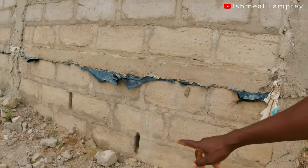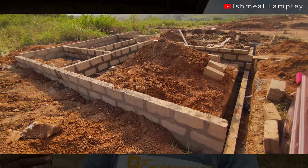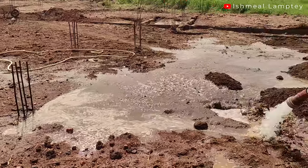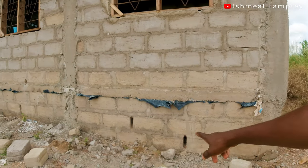One thing we had to take into consideration when doing the foundation was the spaces you'll notice at some points between the blocks — this was done purposely for the filling part. When you're done with the foundation, you have to fill it with gravels or laterite, which gets compressed or rammed in before you do the floor on top. Sometimes it rains to soak the soil, but if it doesn't rain you pour water on top. If you don't have these spaces between the blocks, the wall could crack or get crooked because the pressure of the water tries to find its way out of the foundation.